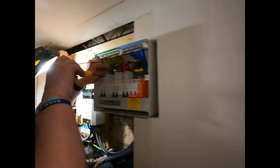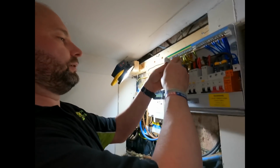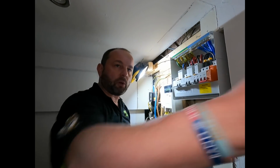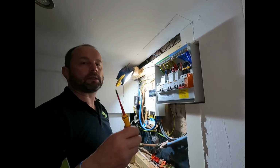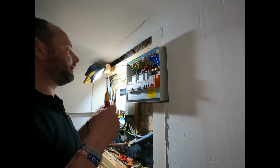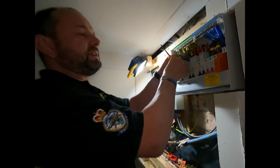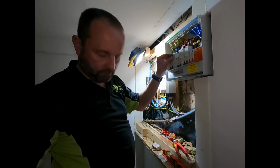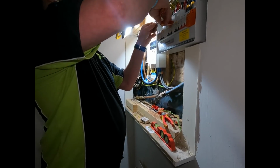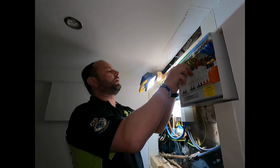Yeah, looking good, mate. It's coming on all right, isn't it? Yeah, getting there. Just putting in the last circuit now. They've got nice circuits in here. You've got three lighting circuits. One does the bulkhead at the top of the stairs. The second does the downlights in this room. The third does the rest of the house. Normal, really. These days it won't overload the circuit, but if you get a fault, then that's the whole of the house lights off. But what can you do? I'm not here to rewire, I'm just here to polish it up and make it look good.